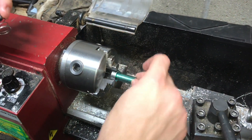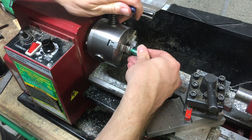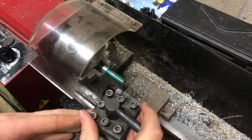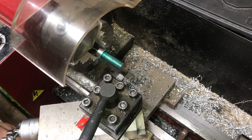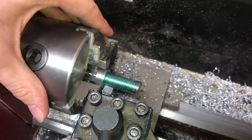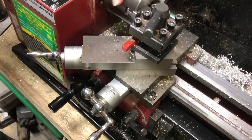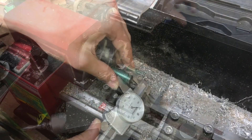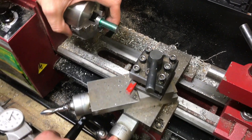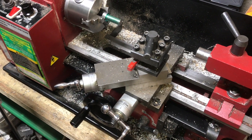You may have noticed that after doing the facing cut, there's a little bit of wobble going on. I think it's kind of pushing it around since there's all the leverage out here. So I'm just going to reposition it in the chuck — there we go, it's back straight again. Now I want to get my relief back on the front of my tool so that I can turn this down. I really just scratched the surface. What I can do now is set my dial down here to zero, and I know that's right on my surface. I can take my measurement and see how far we need to go. I was at 87 before and really didn't change much. I still need to take 20 thousandths off, but that's on the diameter. This machine measures in radius, and it's always very important to remember which one this lathe is, so I actually need to go in 10.